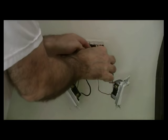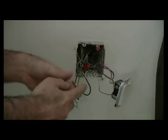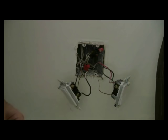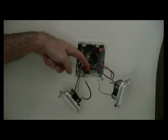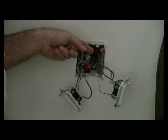One thing that I do as an electrician — I go back behind and make sure that I'm the last one in the box. To prove that, I wrap all of the wiring closed with electrical tape. That way I know I'm the last one in. Once I inspect that, I go to the black one — I've already inspected that and all the connections are good — and I'm just going to wrap some electrical tape on it as well. It serves two purposes: one is to get my mark in the box, and two is to ensure there's no electrical wiring touching outside of caps, because sometimes wires are cut too long.